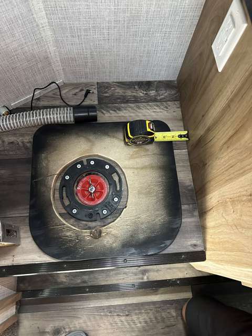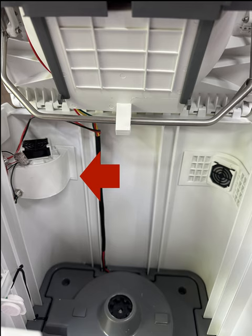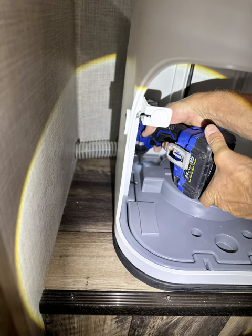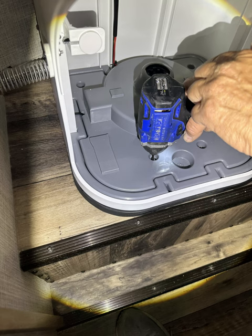Here we are installing the plywood base — I went two inches from the edge of the counter of the sink. These are the screws I used to screw down the wood base. These are the directions for the venting of the tank. Inside the tank, you can see where the vent and fan can go on either side — because of the way the tank sits near the wall, we had to put the fan to the left side and the intake to the right side. Super easy. Once done, tie-wrap your wires out of the way. We used the stainless steel screws that came with it to go into the base — one screw I had to use a slightly longer wood screw with a washer to go around the flange to the base. Once this thing's in there, it's not going anywhere — it's in there pretty tight. You can see the plywood black base on the bottom; it came out really nice.